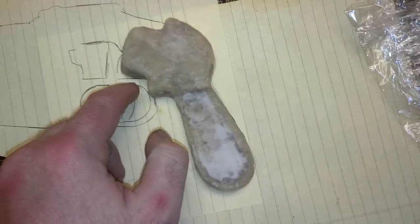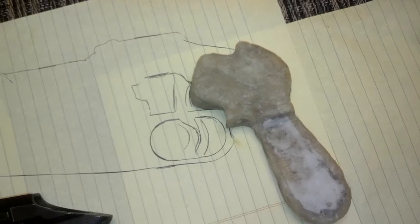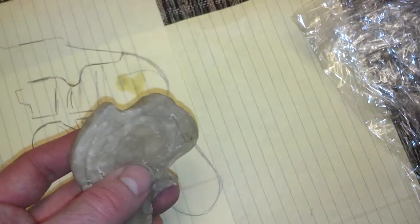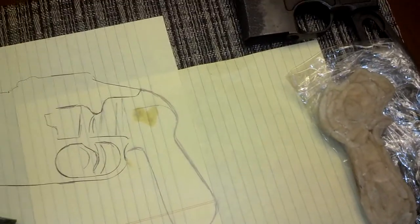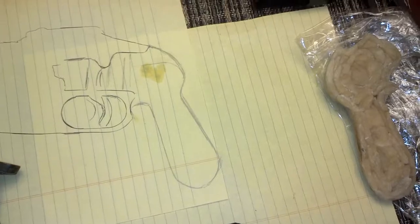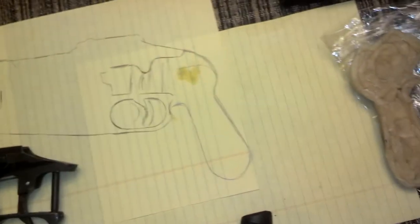I'm going to need to make it a little more oversized here, actually, and then build up the sides on the actual receiver so that it does a little bit of a wraparound. Then you just build it up as needed, flip it over, and duplicate the piece again. I got to the point where I was duplicating the piece and tried to do it with the paraffin — it's just that stuff is so slippery. I don't think it's even real paraffin; it might be paraffin and petroleum. I was using those little votive candles, and it was just horrible. Made a mistake with that, but I have the drawing now, and I think this setup's going to work.